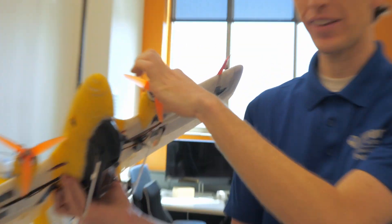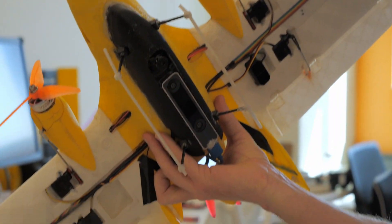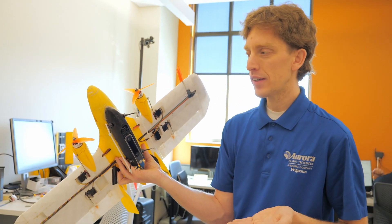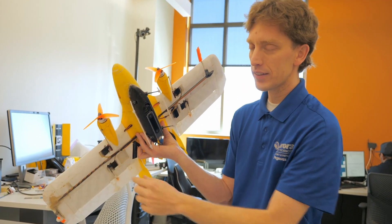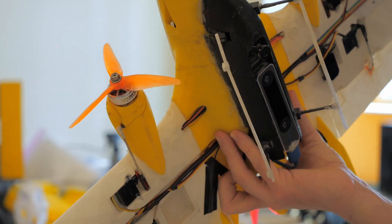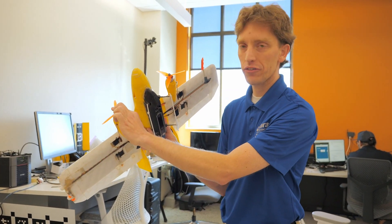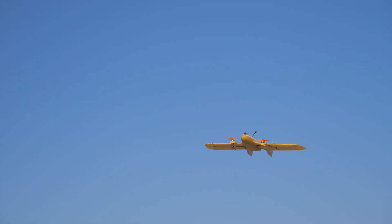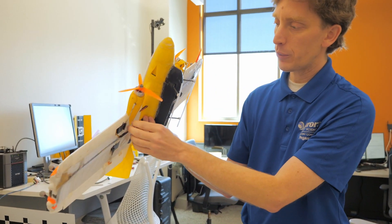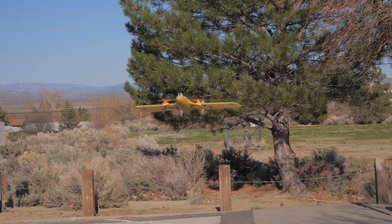With this twin-motor design you're wildly overpowered, though there is a mild compromise: the mechanical complexity of having two servos. A lot of designers don't like that, especially for larger VTOLs with separate lift-plus-thrust configurations like a quad plane. But I like the tilting mechanism — it just feels cleaner. The other compromise is that your front rotors have to double as both a forward-flight propulsion system and provide sufficiently low disk loading and proper control authority for hover. So we have a mildly complicated optimization problem trying to get these front rotors into the Goldilocks zone — not too much thrust, not too little.